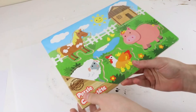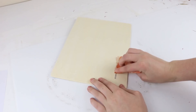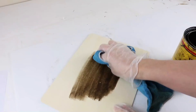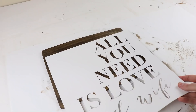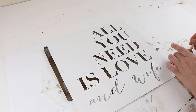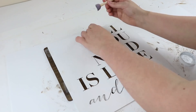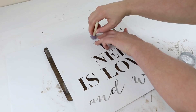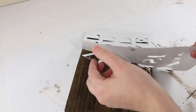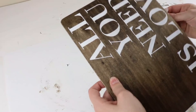To make this sign you'll want one of these kid puzzles. You can either take out all the pieces or glue them in, then sand off the text on the back. Go ahead and stain the whole thing using Dark Walnut Minwax stain. For the lettering I used a stencil from Joann's — I'll leave a link below — taped it on and used Waverly chalk paint in white to stencil it on. Since I did two layers of white, it spilled through a little bit — just take some acetone and a brush to go around the letters, then a little bit of stain, and it'll clean right up.